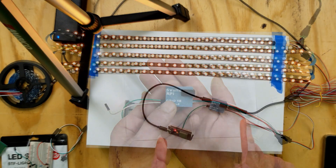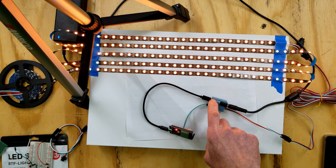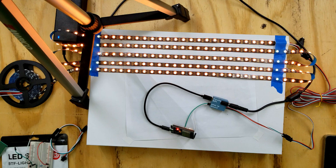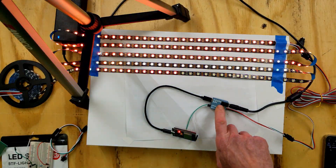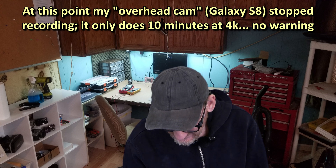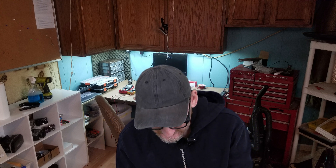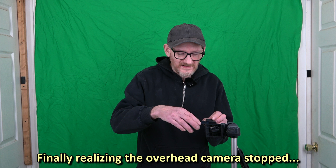Let's put the Hyperion version inline. In this case, instead of powering the ESP or Raspberry Pi directly from 5V, we're running it through its USB connection. When I sell the Hyperion version, you get the choice of Type-C or Micro USB depending on your Raspberry Pi, but it can also be used with an ESP. We're now putting power directly into the level shifter and it's supplying power to the ESP via USB rather than directly through the pins. This is especially important on the Raspberry Pi — powering through USB protects you from overvoltage and overcurrent. In this setup we only need the green wire and the white wire — a ground and a data wire.